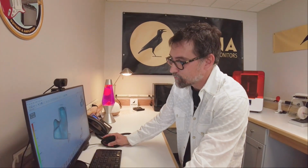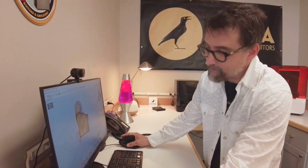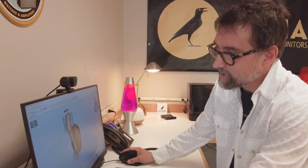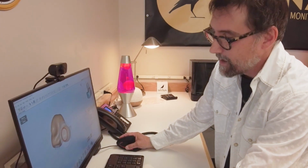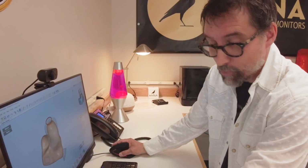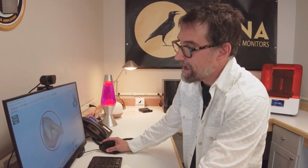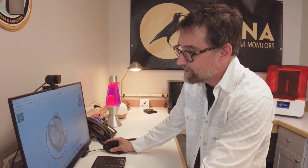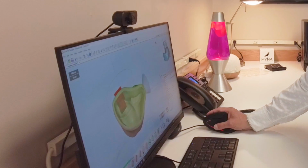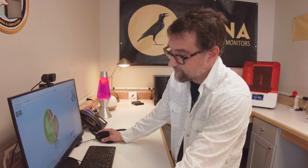With the modeling process, there are some really unique things that we do here at Myna. The canal length is to the second bend so that it gives a good acoustic seal as the customer is wearing the product. It's a double sound bore so that the sound actually enters into the ear canal and is mixed naturally within the ear canal itself rather than down in the ear mold. Unlike many of our competitors, we have a very thick shell so that it's strong and robust and rigid out in the field, and it doesn't break easily. I put a connector port in the side of the earpiece, at the crux of the earpiece, and that's for the cable that will connect to it later.